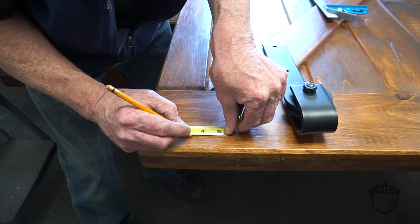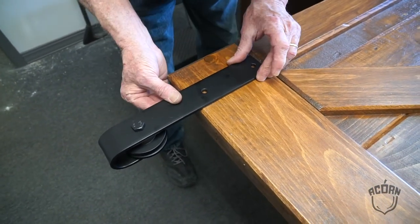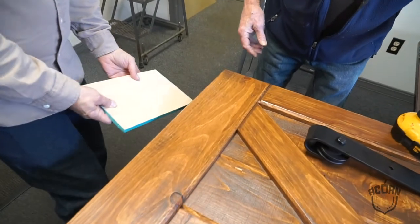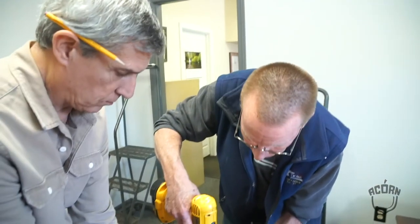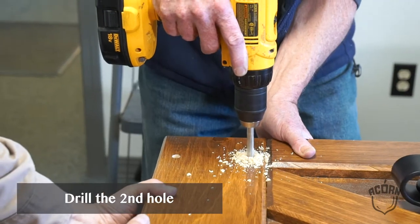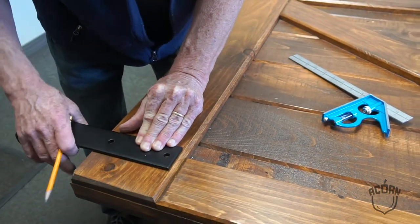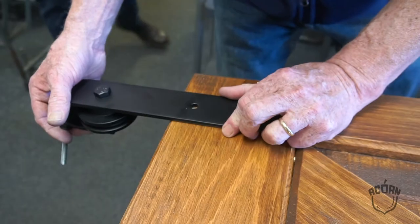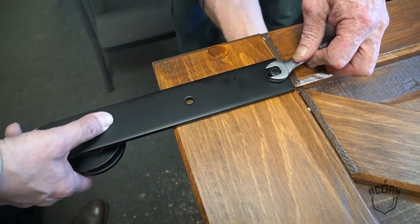According to the top hole here, three and a quarter inches in and one inch down from the top edge. Place the roller assembly onto the door and locate the second hole, marking the center of that as a guide for the drill. I'm going to drill through, placing a board on the underside just to help protect the opposite side of the door, and drill all the way through. We're doing the same measurements on the opposite side, marking the second hole and seating the drill again. Place the bracket back in place — coming from the opposite side with a nut, tightening the bolt from one side using a ratchet on the back side. Not completely snug yet.